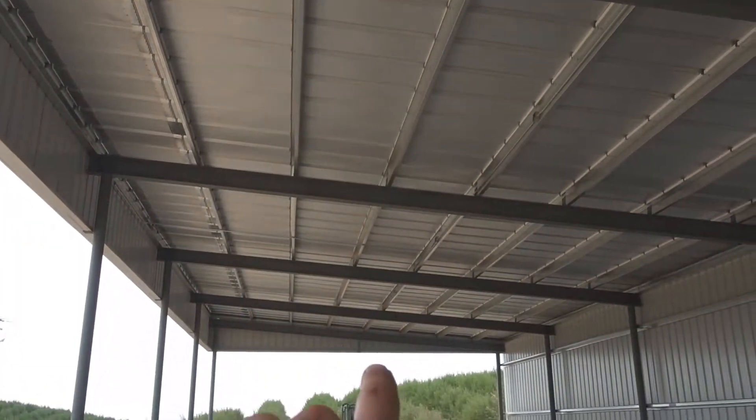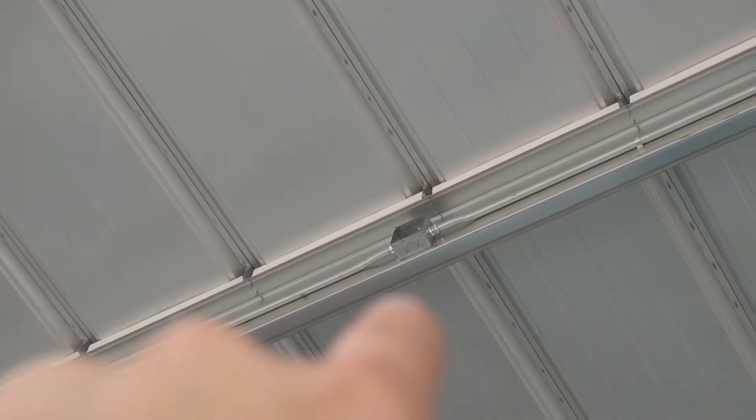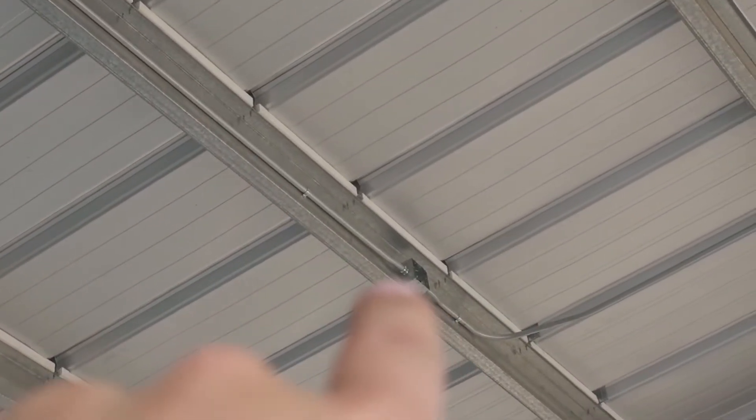Let me check in and show you some progress. If we start at this end where the panel is going to be, I've run a conduit down through here. I've set a box where each light will go - you can see this conduit right here, there's a box there for a light, and that pipe runs down to another box. We've piped out to the end where we'll set a wall pack on the outside of the building, and that conduit runs all the way down to the middle wall pack.